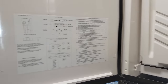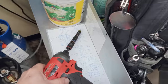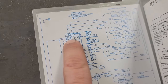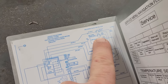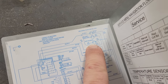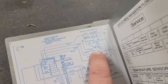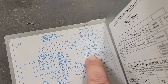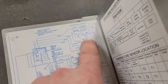Kind of need to look at the schematic here. Let's see what that fuse protects. Coming right in here to the schematic. As you can see, these are all the outputs going to different devices. You have a water valve being powered by it, an air pump, high pressure solenoid, HPR solenoid, harvest solenoid, dump solenoid, water pump, and liquid solenoid. So any one of those things could be it.